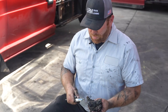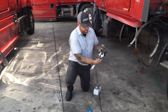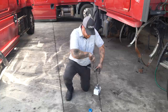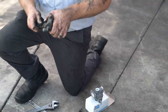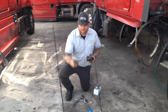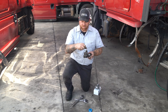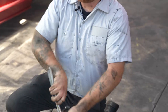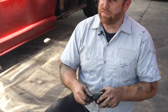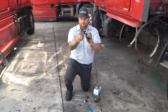This is where the two crescent wrenches will come into play again. You'll see there's a spot where you can put your crescent wrench to hold the fitting from moving, then apply the other wrench and start taking it off. Once you get all the fittings out, you don't have to worry too much about orientation because they're all the same size. Just remember: you'll have a flare-looking fitting on the sides, and the push-on ones will be one on top and one in the front.